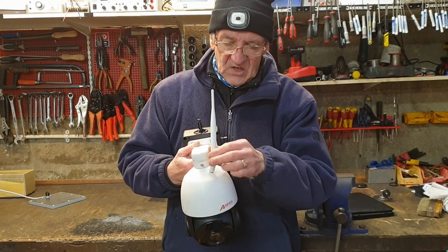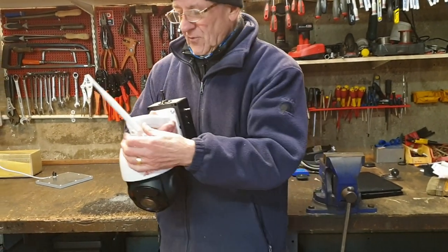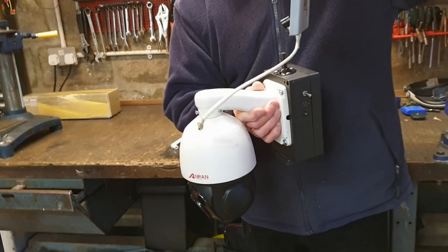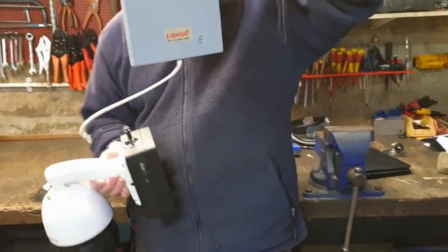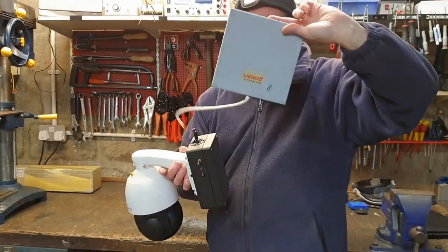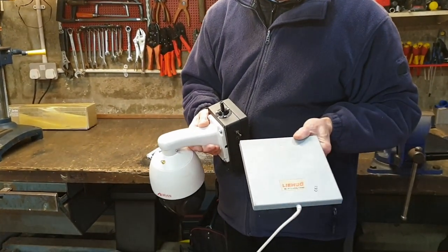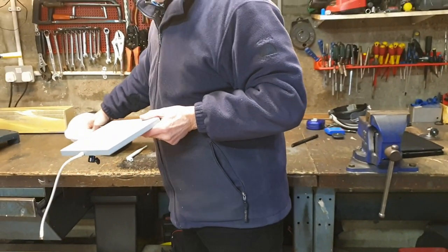It still has its own Wi-Fi hotspot. The antenna that comes with it is good for about 100 yards, but if we replace it with the flat panel antenna, you can just put it into this housing on the back and plug it in. Because it's on a spigot, I can have the camera pointing in any direction and have this pointing in any direction. As long as this is pointing back towards the firing line, you're going to get 600 yards easy. It's a commercial transmitter — you don't need gun sights to line it up at 650 meters away. You just need it roughly in the general direction, and that's good enough.